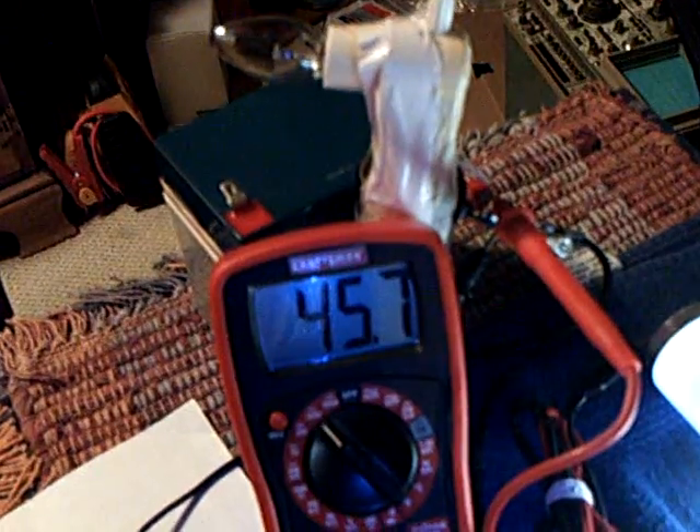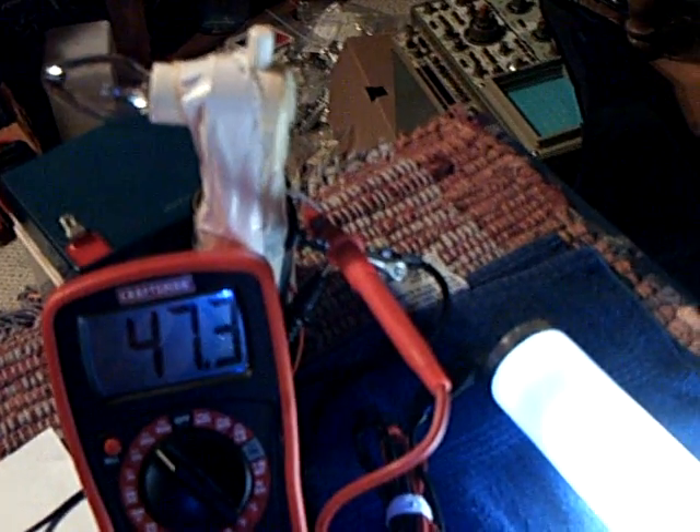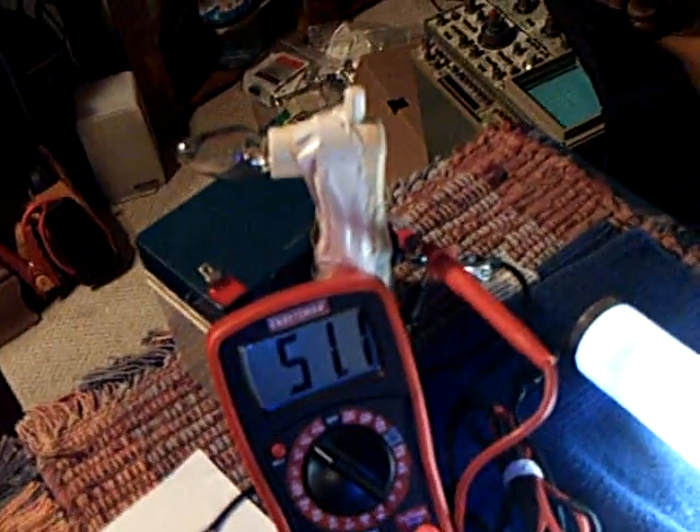If I turn this off, I can get that to come on real bright — now that's on real bright. You can see what the capacitor's doing, it's just going right on up, and that's loading up on the capacitor. But the downside is that costs me a lot of power to do the bright light and the charging at the same time. Now I'm up to 500, 600 milliamps. So this is one of those things where you get what you pay for — you want the bright light, it's going to cost you. Or you want the big charging, it's going to cost you.